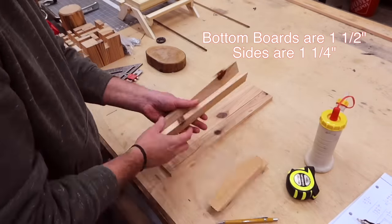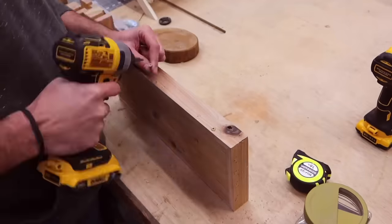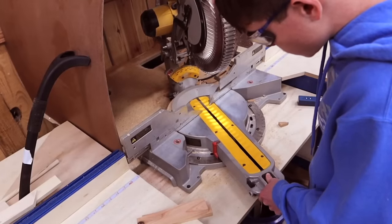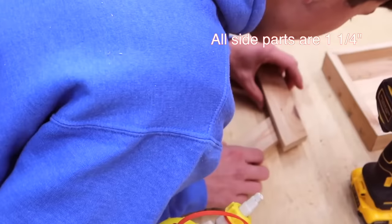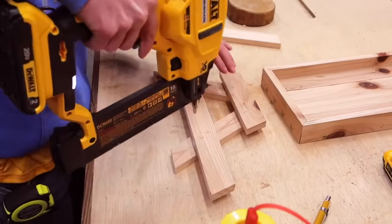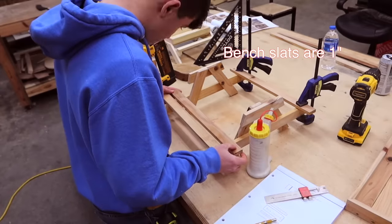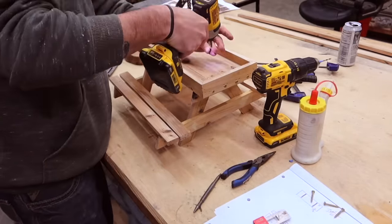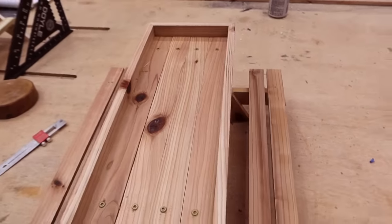Once parts are cut, start by gluing together the bottom then putting the sides on — brad nail the parts into place, pre-drill the sides and ends for 1¼-inch deck screws. For the legs, cut them at 8½ inches with a 30-degree angle on each end, then adjust your miter to 20 degrees to cut the top bar and bottom bar. With both ends cut at 20 degrees, the top bar is 7½ inches tip-to-tip and the bottom bar is 17 inches. The top bar sits flush with the top of the legs; the bottom bar is 1½ inches up from the bottom of the feet. Glue and brad nail into place. Build both ends, then attach benches — 17 inches long, spaced two inches from the ends of the table. Finally, square everything up, measure in two inches from the outside edges, pre-drill, and install 1¼-inch exterior deck screws.